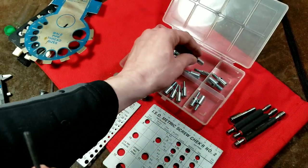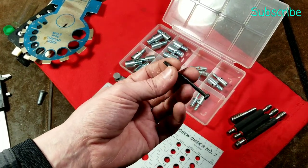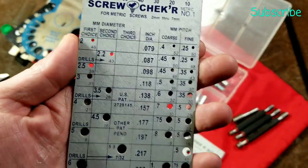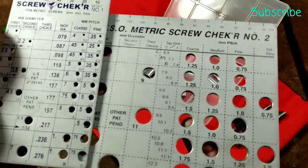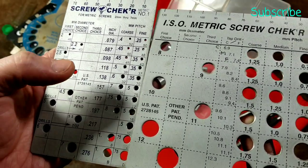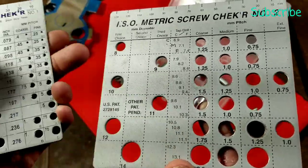What's nice about these deeply threaded ones is if you have a fastener where there are sizes between fractional and metric where the threads are so close, they'll both thread into each other until the hole gets to about 10 millimeters or three eighths of an inch deep, and then the offset of the thread starts to bind up. That's what makes these plate-style screw and thread checkers sometimes good but sometimes bad — most of the time they're excellent. There are only a few sizes where you have to really worry about a false positive. But what's great about these screw checkers is they give you all the drill sizes, from optimal to whatever might be close enough in a fractional drill index, plus tap drill and direct metric measurements showing what would be optimal as first, second, third — sometimes even fourth choices.